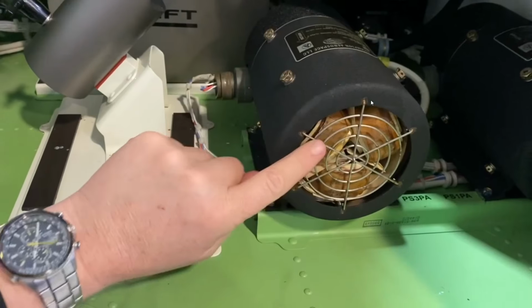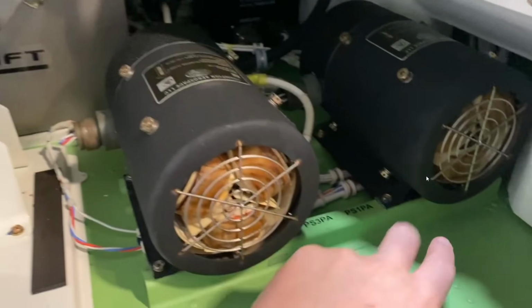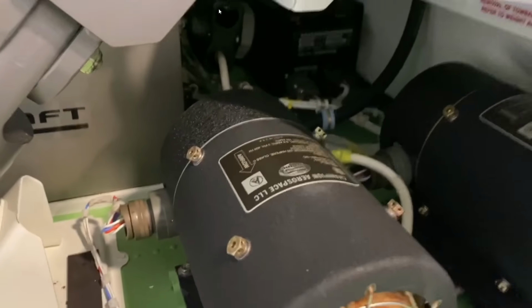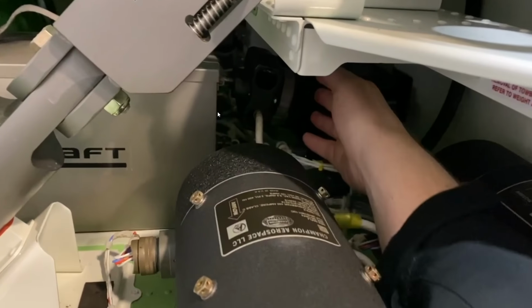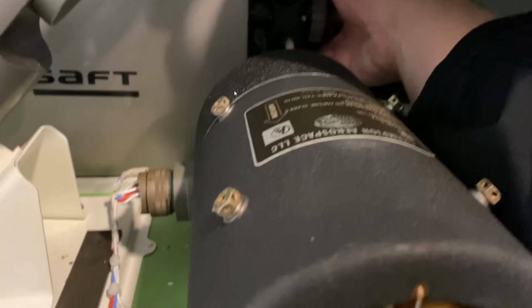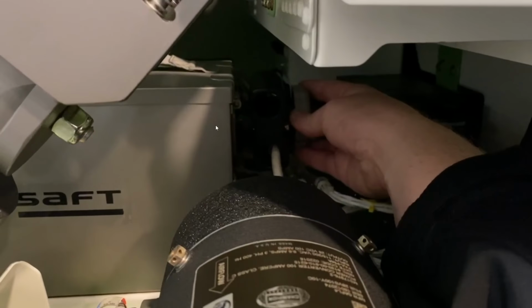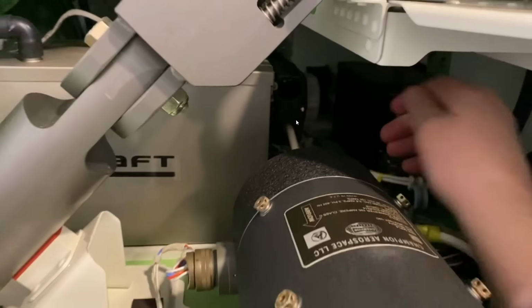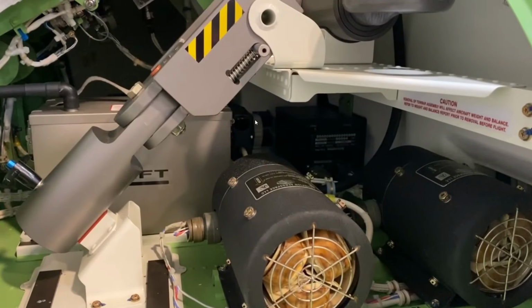There we go. There's a TRU talking about the soot, looking for any damages to the TRU wires. And there's the battery connection right there. So I'm going to push it. There's a pin. I push it in. It falls into the female receptacle, and then I rotate the locking mechanism and give it a pull to make sure it's not going to come undone.